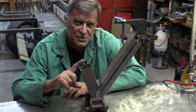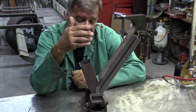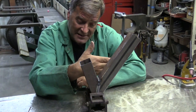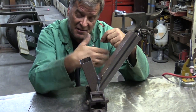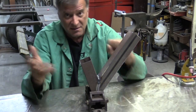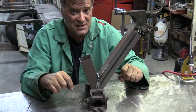So that gives you several different options for how to get down into a tight joint like that. One other thing I thought of while I was sitting here welding: if you're using your regular torch, you can always take a little piece of scrap and make a little dam — block off one end of it while you're working up inside there to keep the air from blowing through and help keep your argon down in there. You can dam it on one end or the other. You've just got to play with it, figure out how to do it. Start with your scrap, figure it out, then come over and work on your piece.